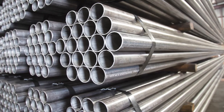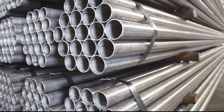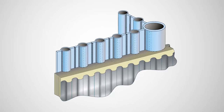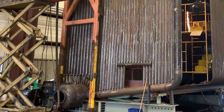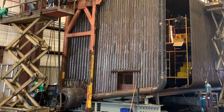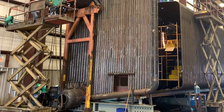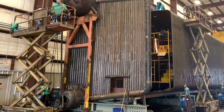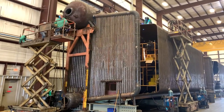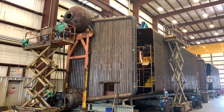Now that we've seen how drums are manufactured, let's look at tubes. Every industrial water tube furnace utilizes an innovative welded membrane wall design. Cleaver Brooks' unique design utilizes 100% membrane construction, otherwise known as water-cooled, on the furnace front and rear walls. This design reduces refractory maintenance and eliminates corner gas seals, which are a significant safety and maintenance hazard on older designs.